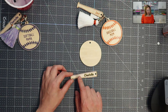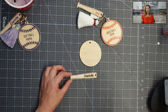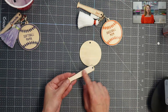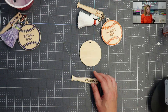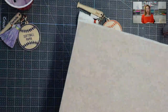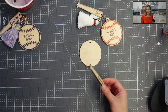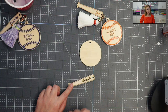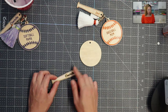The name on this bat — this line right here is an engraving line, so it doesn't cut through. On the back side you have a full bat. I kept the masking tape on. The materials come in taped top and bottom so that you don't burn the material as the laser cuts through it. I leave it on because if you want to paint it, you paint it, let it dry, and then you peel off the masking tape. There's no cleaning to do.